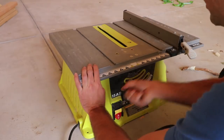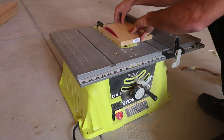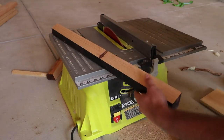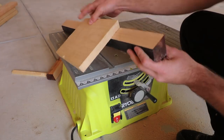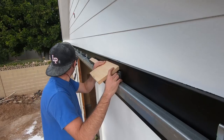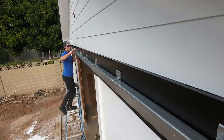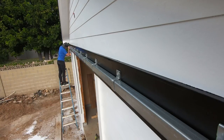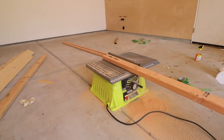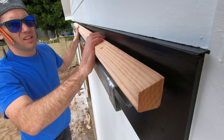Next was the track cover. There weren't many examples of how to build this, so I had to create my own design and hope it worked. In the end, I think it turned out really well. I angled the saw to 20 degrees and ripped a few sample pieces, then brought those up to the rail for a test fit — everything looked good. While up there, I realized I forgot to tighten down the set screws on the track rail, so I went ahead and did that. Then I started ripping the 2x4 support beams — two 8-foot pieces and one 10-foot piece. These have to sit on the brackets so that where two boards meet will be at the center of a bracket.